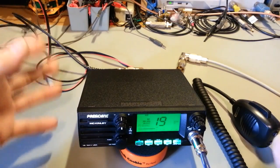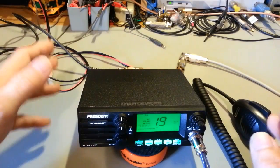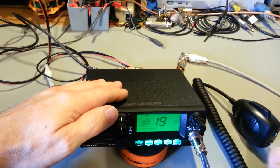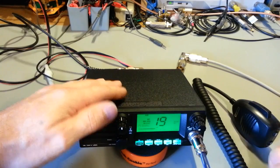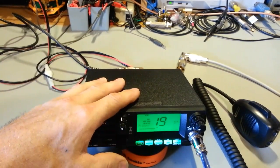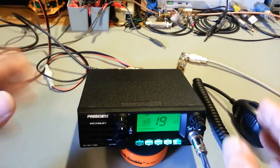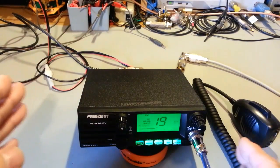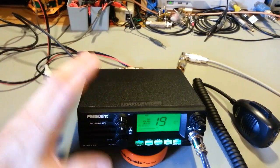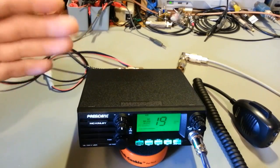in reality, a lot of other radios sound better than that. I can put 1 millivolt into a radio, one channel off. A lot of your really good, high-quality radios, you won't hear that audio tone. And that static, you'll always hear some static increase. That's just normal, because that is a big signal on the adjacent channel. But usually it's not quite as bad. Now, it's not horrible. I've heard radios that are actually horribly worse than that.